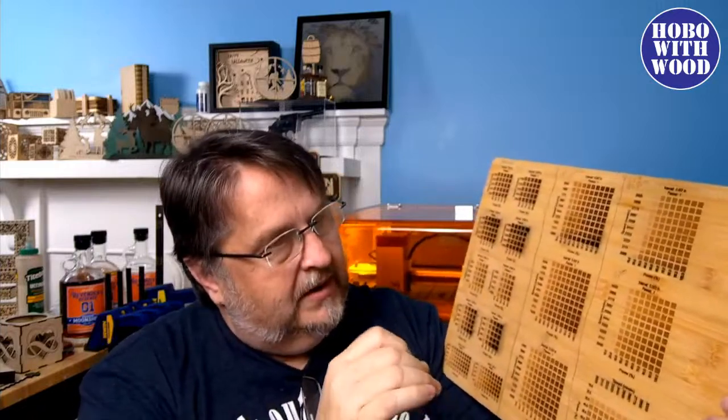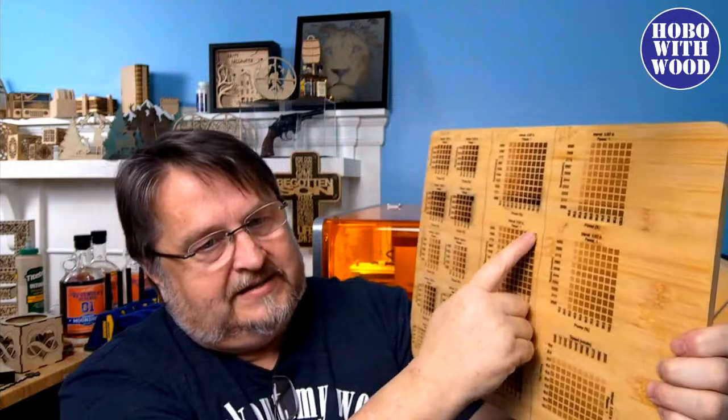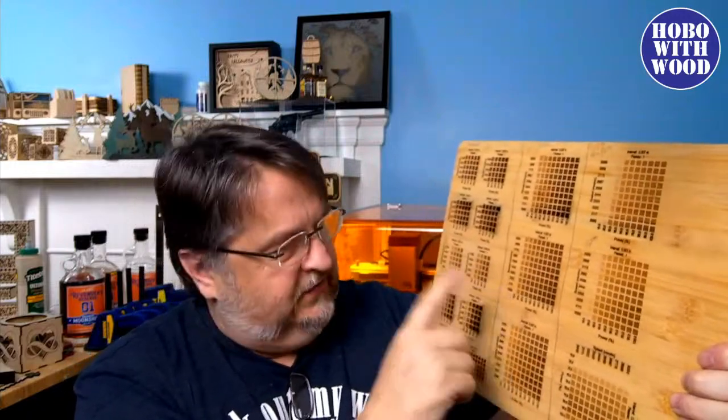And I said, well, I'm going to try that a little bit. But I was getting such dark engravings all the way up. I said, and it has a maximum speed of 24,000. But I didn't know what it was at the time. I knew it was 30 on the X, but I didn't know what Y was. So I did this test from 20,000 to 30,000 millimeters per minute.